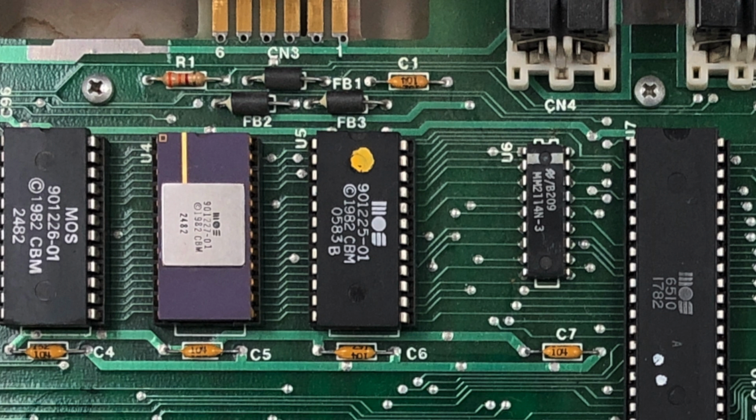These 4K programmable ROMs had been created by Al Charpentier at MOS Technology and were being sold to external customers before they were used in the C64. By 1982, there were 3 million of them in use in other applications, seemingly working without issues. On the C64, the VIC-2 and the 6510 alternated control of the system bus, and when control passed from one to the other, voltage spikes sometimes resulted. On occasion, the character ROM chip would see these spikes as a valid address, and therefore provide invalid character data to the VIC-2 chip.